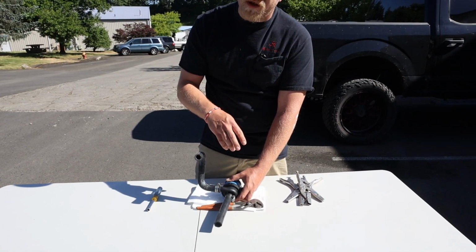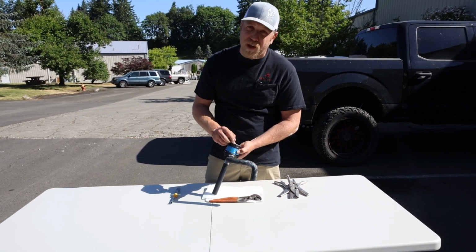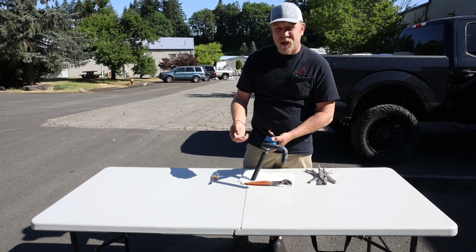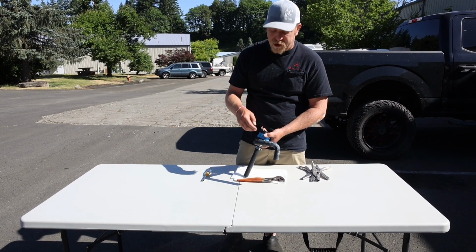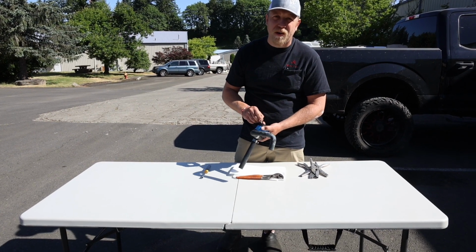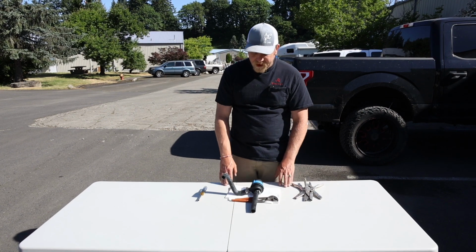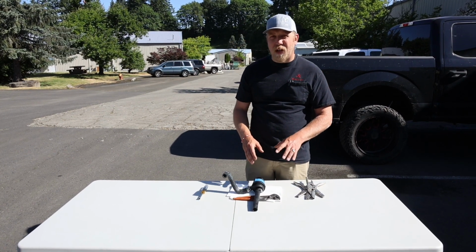If you can't visually see circulation, then you may want to swap the white wire over to the ground for that high output prime speed. Then you should see circulation. Once you've seen that circulation, you can swap the white wire back to power, go back to the normal operating speed. That should cover most applications.